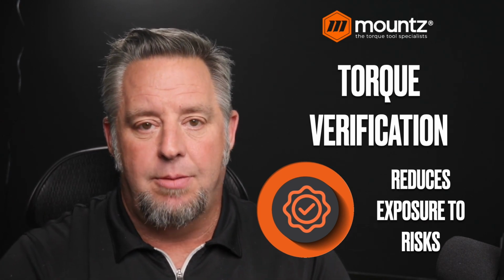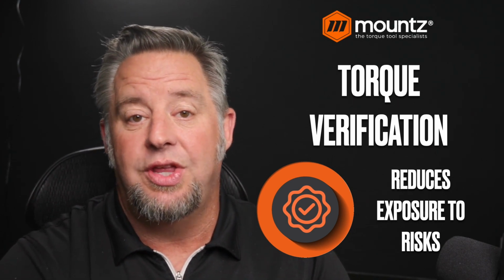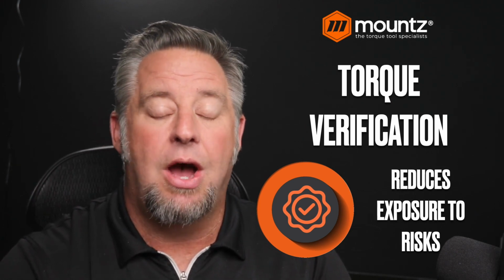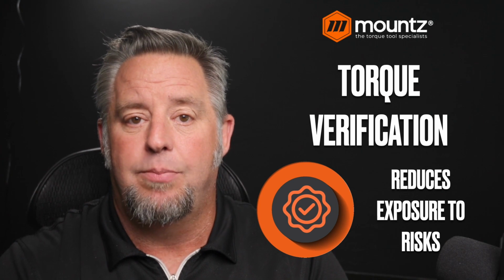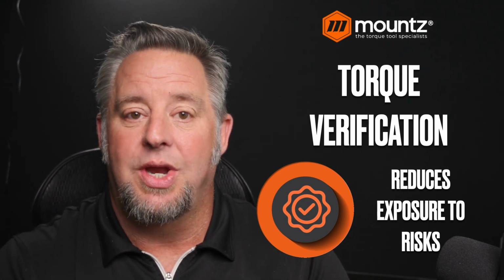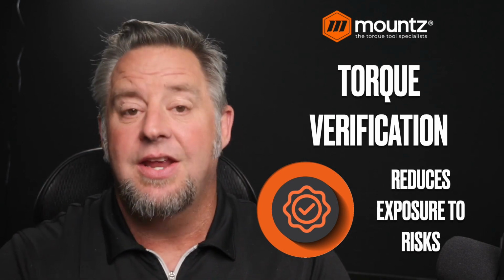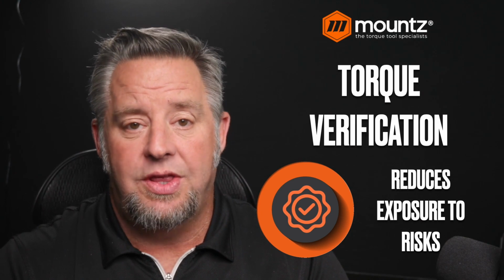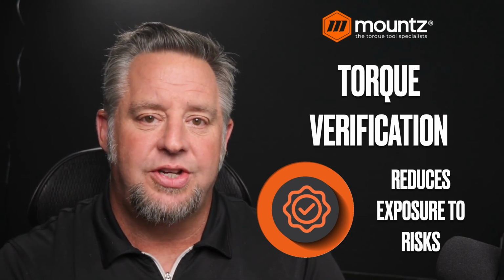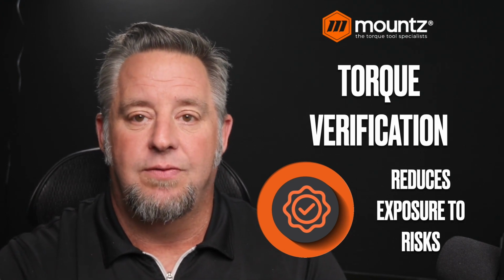So if we have that ability to monitor the tools while they are still within their calibration period, and we know that they're not out of the calibration parameters, then obviously we can be confident that when we get those tools back from their recertifications, that they are still within their calibrated limits. So again, the torque verification process just helps to reduce any exposure to those types of risks.